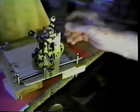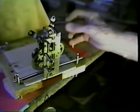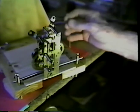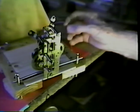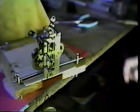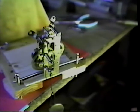However, if you bring the temperature up quickly, and if you use what we commonly call a soft flame, then you can avoid the fire scale. There will be practically none on the surface. So that's what I'll do.